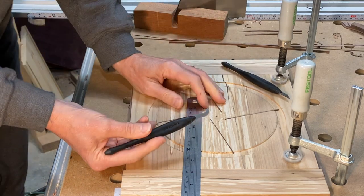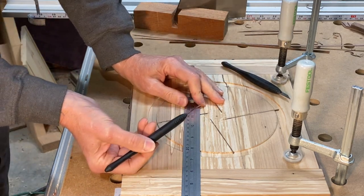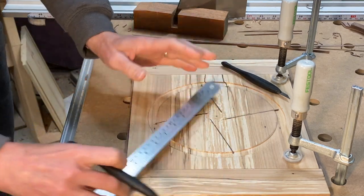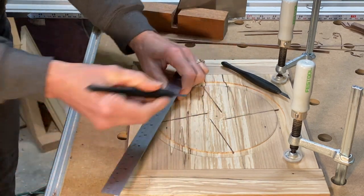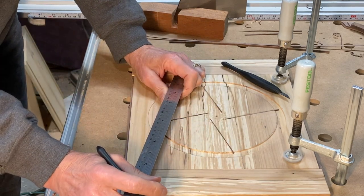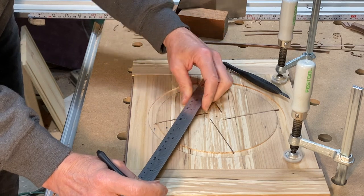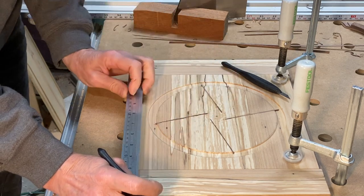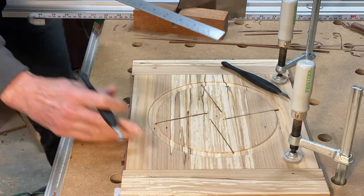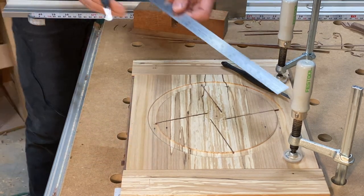The Veritas inlay tools don't require a beam to go across, but they do require a straight edge for a straight line. You can use these as a curve in the middle of a field or for following any kind of template that you might have. For this I can use just a straight edge like a ruler to go along and it works fine.